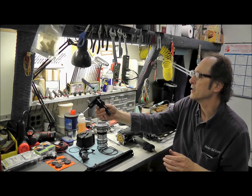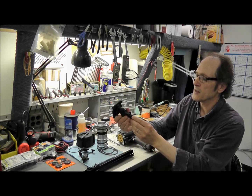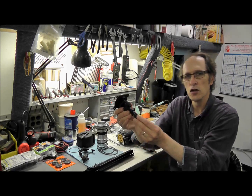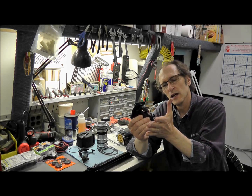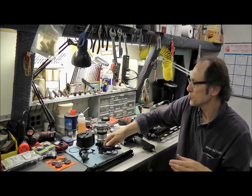This is the nose of the gun. The nose is a very expensive part, typically, so you don't want to get this damaged or break this because you've got a lot of money tied up in it. They'll usually have a safety mechanism where you have to depress the work piece against the nailer for it to be able to allow you to pull the trigger.